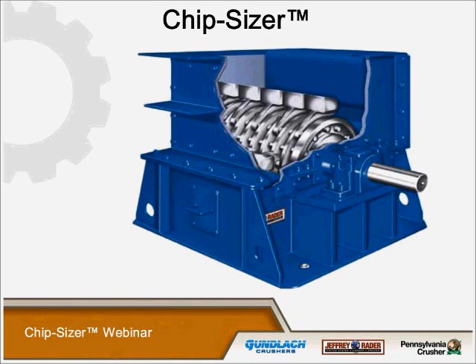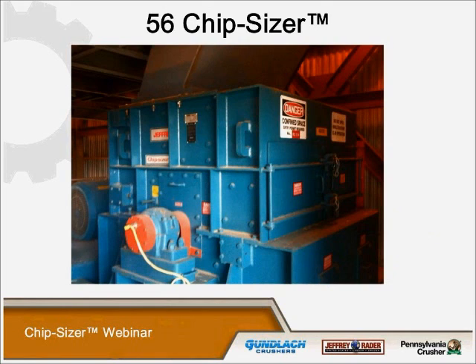We do that by fracturing the chip along the fiber lines to reduce shear perpendicular to the grain, which produces the fines. The chip sizer operates at about one-third the speed of your typical wood hog. This allows the chip to be fractured along the fiber line without grinding the material, which creates the production of fines. The Jeffrey Rader chip sizer was the first true no-knife re-chipper, pioneered back in 1996 as a result of an industry concern over high maintenance costs of conventional re-chippers. The chip sizer incorporates several special features; the hammers allow the unit to operate at much lower speeds — about one-third of the traditional hammer mill, which operates around 1,200 RPM — allowing a softer touch to the chips to minimize the creation of fines. This, along with other patented components, permits the Jeffrey Rader chip sizer to reduce oversized chips at unheard-of efficiencies.